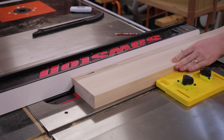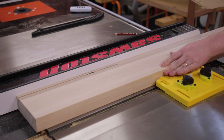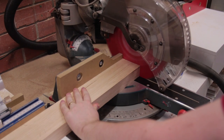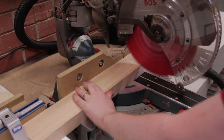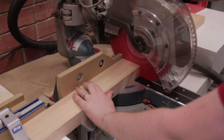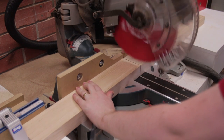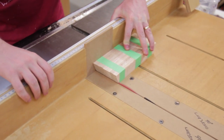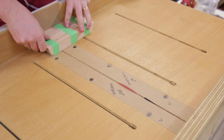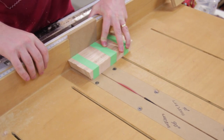To actually hold the board games up, rather than going with a solid shelf I've opted to go with slats — two per shelf. This consumes less material, making it lighter and cheaper, while providing more than ample support for the board game boxes. To match the slats, the angled cleats need to be notched out to lock them in place so they don't slide back and forth too much. These notches don't have to be particularly snug — a little bit of movement won't really affect the shelves.